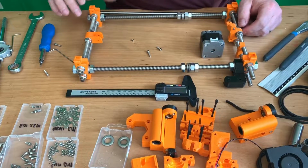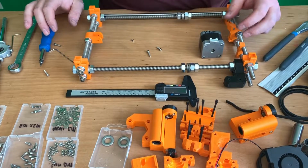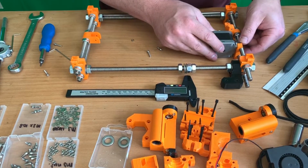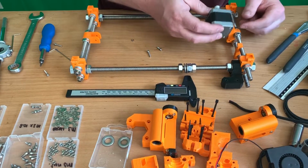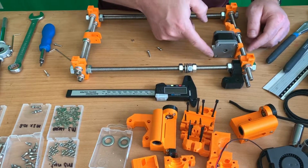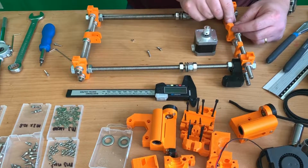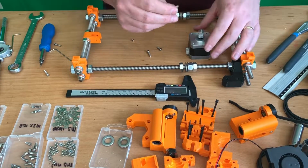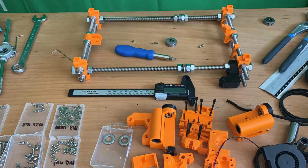Well, Prusa uses a different kind of connector on their NEMA 17 motors, and these are way too big. So if I do this, it doesn't fit. What I can do is leave it like that, or I can twist it 180 degrees so that the connector is on this side, and then we can lead the wire to the back side. Well, first I made my own Allen screws. I used a thread tool. I don't know if I call it correctly. It should fit. I'm going to fit the motor onto the bracket.